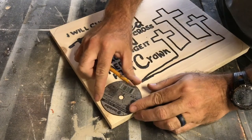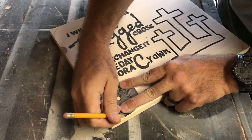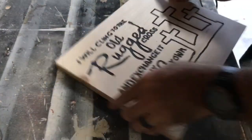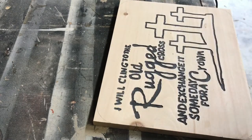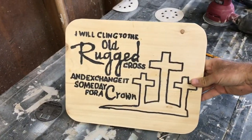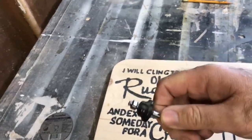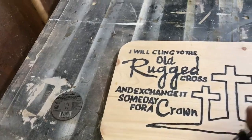Now I'm going to use my template to make sure I get my edges right, because I'm going to take all four corners off with the bandsaw. I'm going to take the corners off and then come back with a router and route the edges. So I'm going to go ahead and fire up the bandsaw and knock them off real quick. This is where we are now — I got my edges all rounded over. It's going to sit in a stand, which I'll show you in just a minute. Now I'm going to take this roundover bit — I guess that's how you say it — and route all the way around the edges just to give it a little bit of a decorative edge.